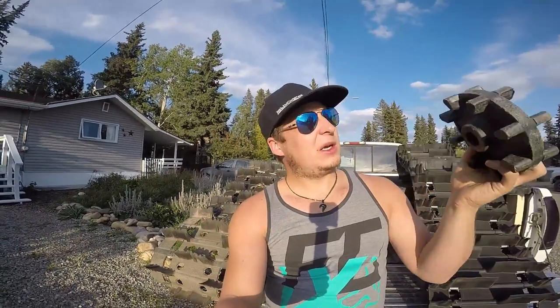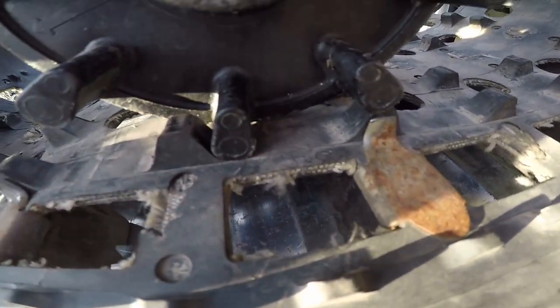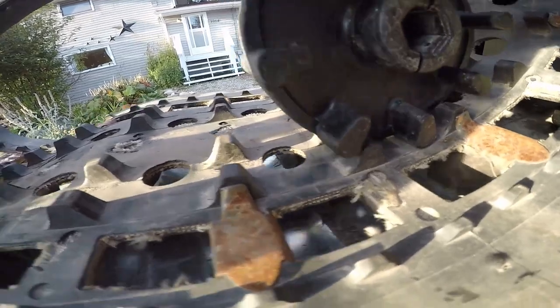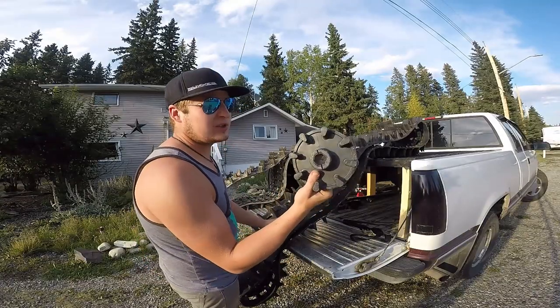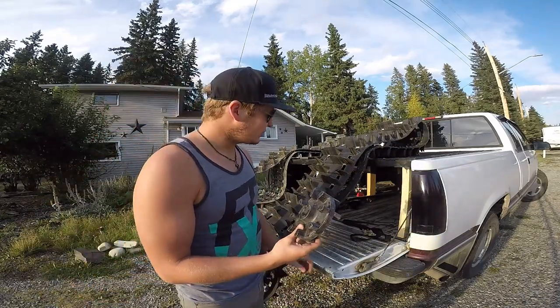Let's see what happens when we have the wrong driver in our three-pitch track. I've got this 2.52-pitch driver and we're going to stick it in and see how well the holes line up. The driver sits like that in the track, and right away — that's already not going to work. The drivers are going to miss, and you can see every once in a while they line up, but the drive position would be back against one of the lugs. If you actually put this 2.52-pitch driver in with a three-pitch track, it would ratchet like there's no tomorrow — it just would not work.